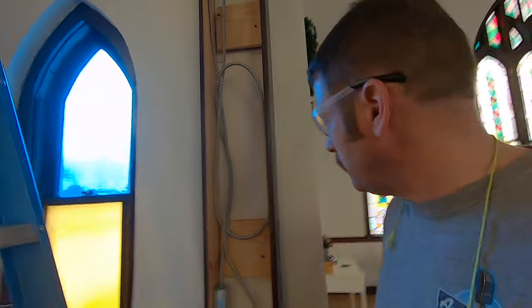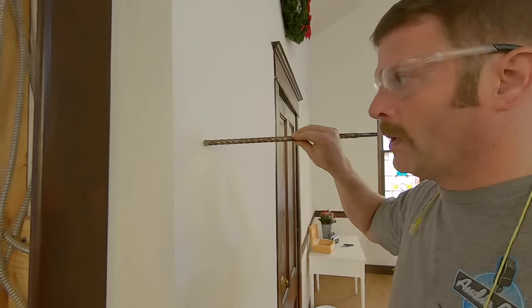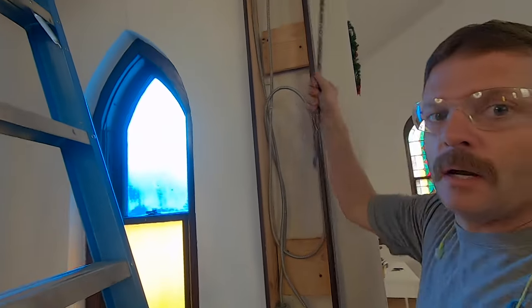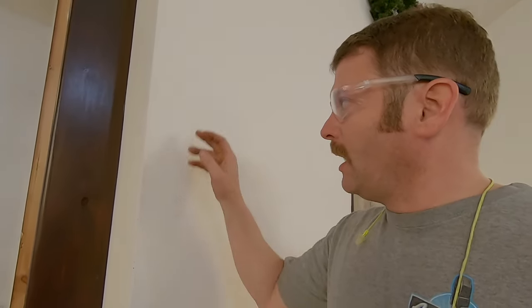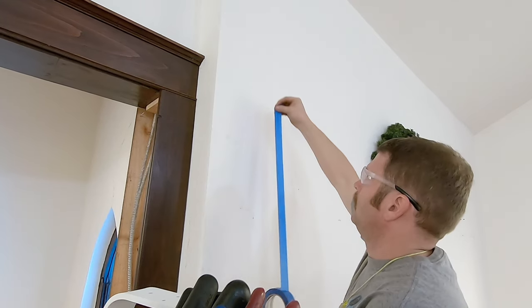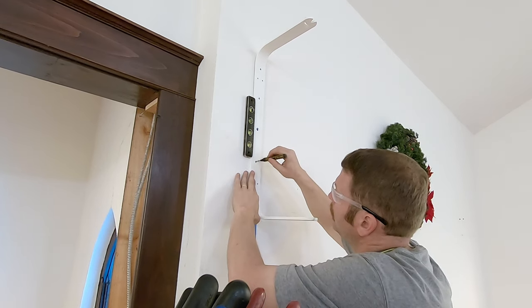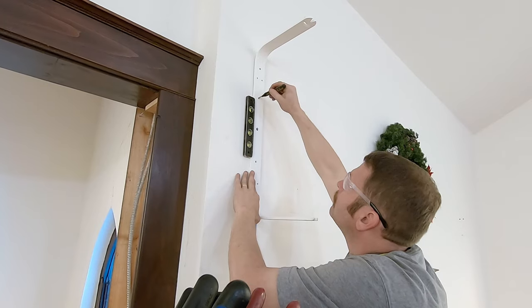I'm going to take the 16 inch masonry bit and drill at an angle through whatever surface this is. I should be able to poke out inside this chase up top. When we use masonry drill bits, we want to make sure that we hold away from any outside corners because this could fracture real easy and just blow off the whole side. I'm going to lay out the marks on the wall, do a couple of test holes to sample what the material is behind the paint, and then prep to drill that three-eighths hole 16 inches into that chase.